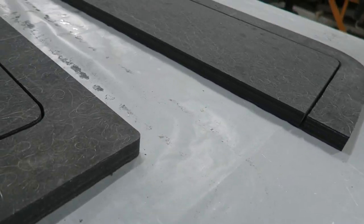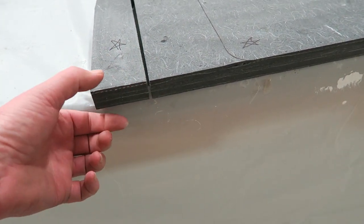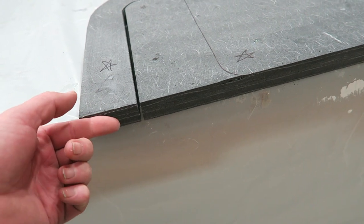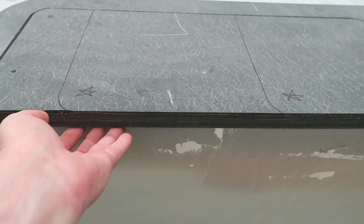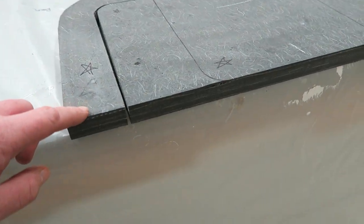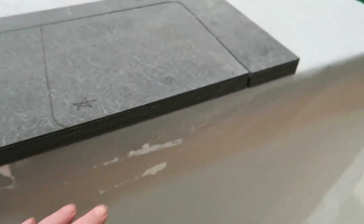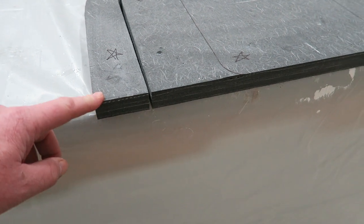There's one more thing I want to do. I want to add on one more piece that's going to get glued onto the butt end here, but it's going to extend down about a half of an inch — so half inch out and then extend down a half inch. What that's going to do is give me a lip along the bottom that I can basically grab onto for lifting the lid. I'll also be able to put on a little bit of a quarter-inch roundover around the tops all the way around so there's no sharp edges to scrape your leg against. And by giving this roundover, that's just going to make it easier to wrap the glass from the top around and back down.